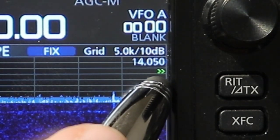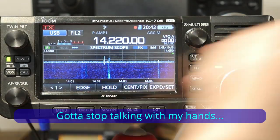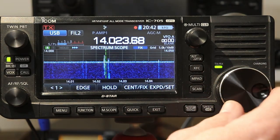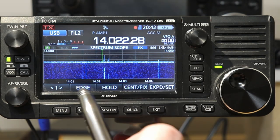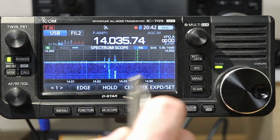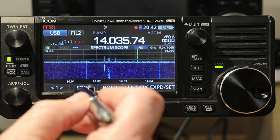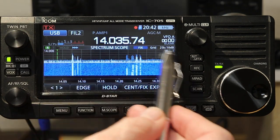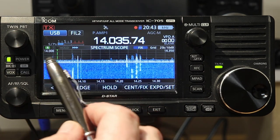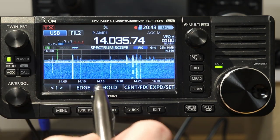I can still use the touch-tune feature — touching the scope will bring me right down there to listen to signals. If you see arrows on the right or the left, it shows you what direction your frequency is relative to the scope. Touching edge one more time takes us back to 0 to 350. The default edges are set up for each band to be the entire band, then the data portion, voice portion, and just the CW portion — and you can create custom edges for a particular portion of the band you work or maybe for a contest.